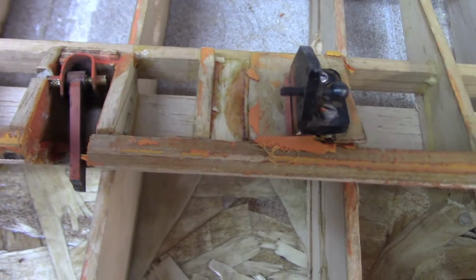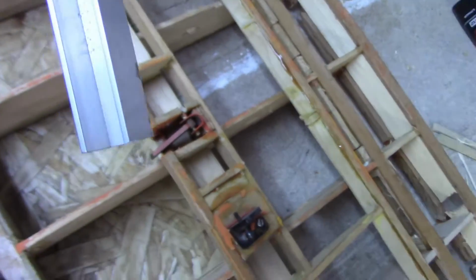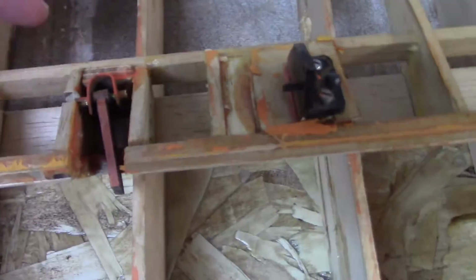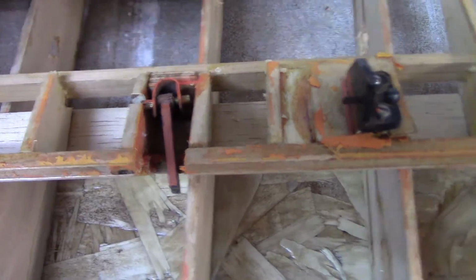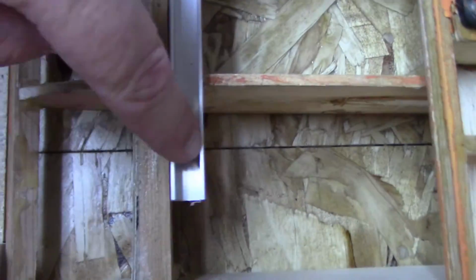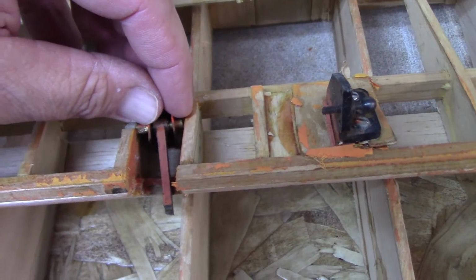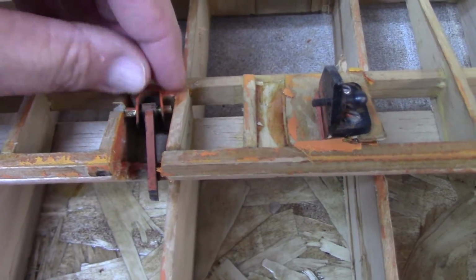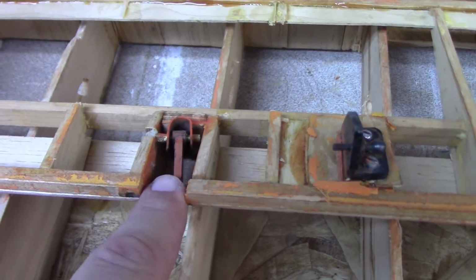But if I'm gonna work with it the same way they worked with it, sorry if I sound snotty because I'm just getting over a cold. What I will do inside here, I will block the sides so that when this piece gets screwed in here, there is little or no side-to-side movement at all, so that one screw going through into the plywood will hold it firm.